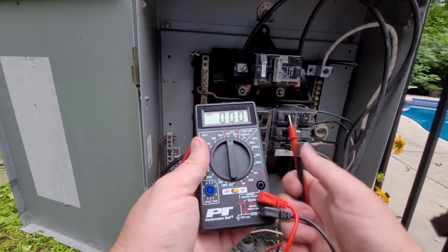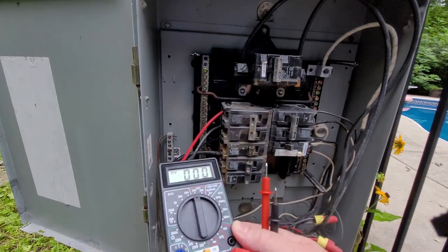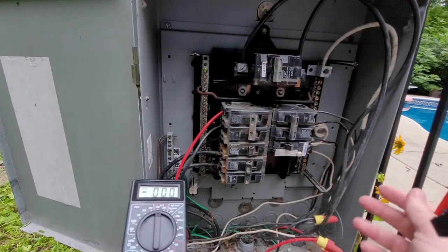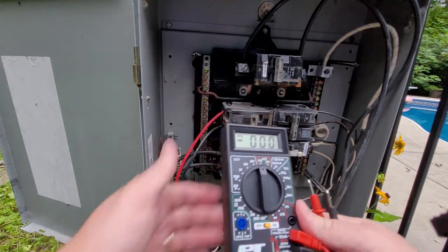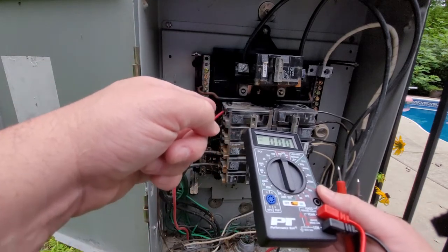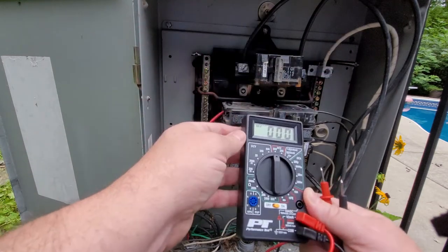In this video I'm going to show you how to bypass a circuit breaker and then how to wire up a new circuit breaker. In this case it's not really just a regular circuit breaker but it's the main breaker to this entire panel. Before anything, first you have to check to see if there's actually any current coming through. In my case the current to this box is switched on and off by a circuit breaker in my house, so I've already flipped that breaker, but I'm just going to show you what you would do to check.